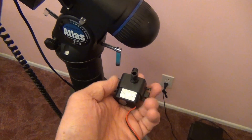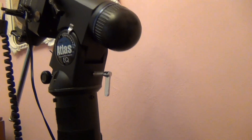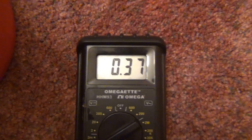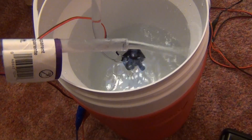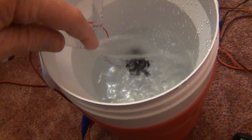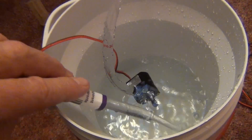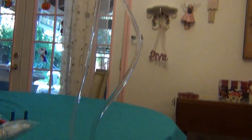I need to test what kind of amperage this little motor draws and make sure the pump can reach from the ground up to the telescope with enough power. Right now the little pump is running at 0.37 amps, going up and over the chandelier — probably about 9 feet in the air — and there's still great pressure coming out. I think it will do just fine moving water up to the telescope. What I'm pushing right now is going all the way up over the chandelier and coming back down, and this hose here is actually 20 feet.